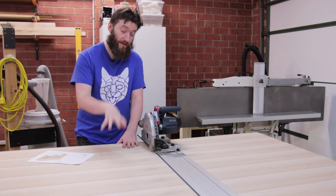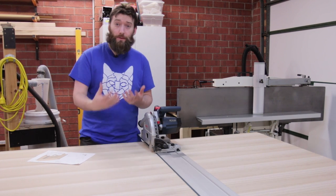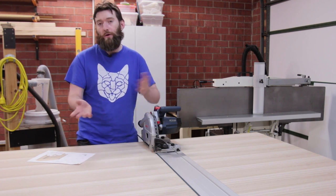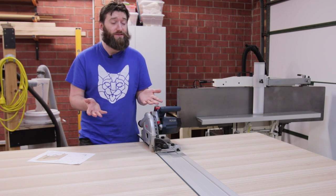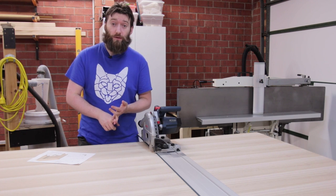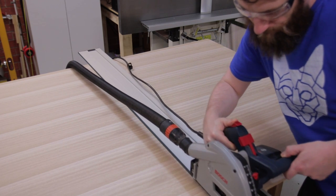What I'm going to go for is this plantation oak veneered MDF — so this is pre-veneered. This works out quite inexpensive. All I have to do is cut it to size and I'm done; I don't need to do any gluing. When people hear MDF they often think of the negative properties like it's not very structural or it's prone to warpage if it gets wet — neither of those are issues here. The panels are simply decorative; they don't need to be there at all, but they'll look nicer. All the MDF will be sealed away. The benefits are it's dead flat and dimensionally stable, more so than plywood. This is less than half the price of the same veneer on high-grade birch plywood, so really for this use it's the best of all situations.